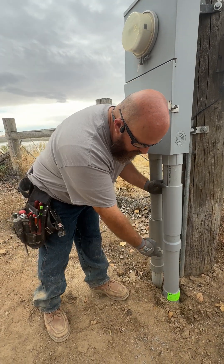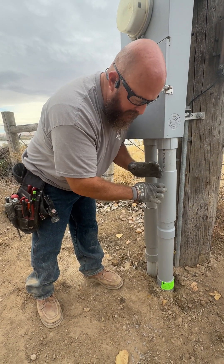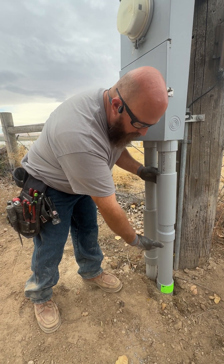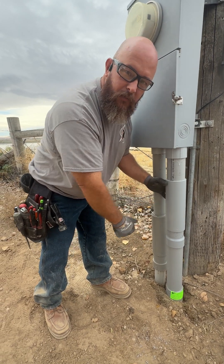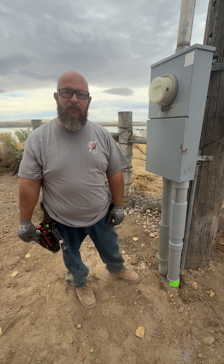By putting this in here — this is a two-piece, and the lower piece sleeves up inside the upper piece with a gasket — it'll sleeve in and out on itself. So during that heave, it would take that heave in and feed up into it, and during that thaw and retraction, it'll pull it back down. So this is absorbing the brunt of that frost heave cycle, therefore taking it off that terminal adapter.